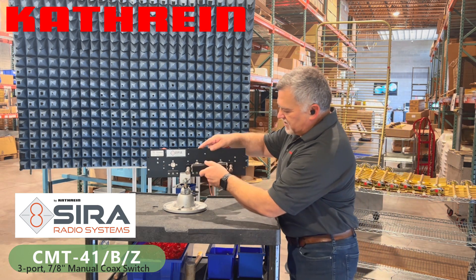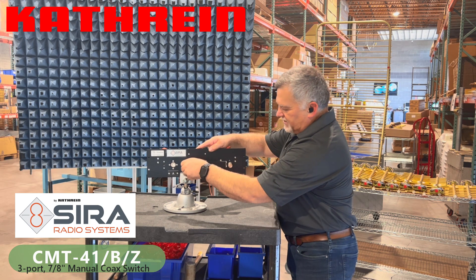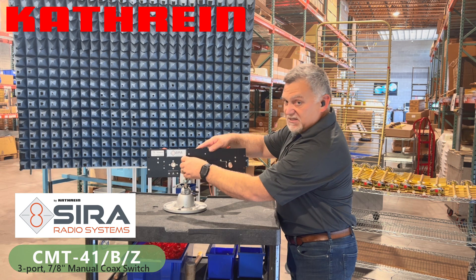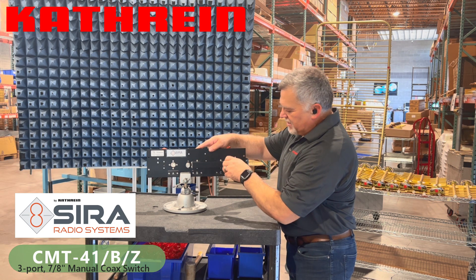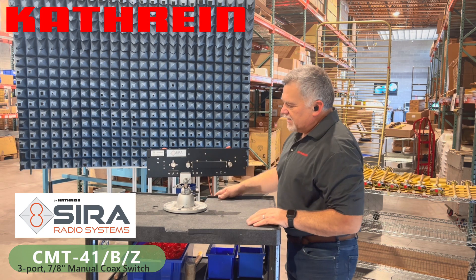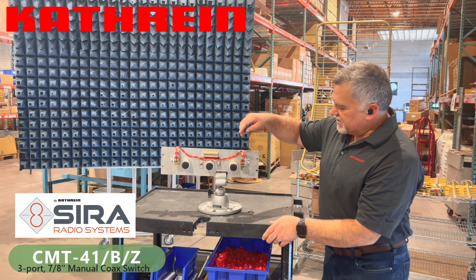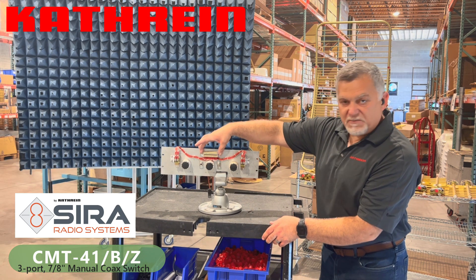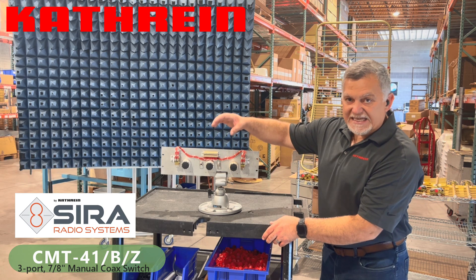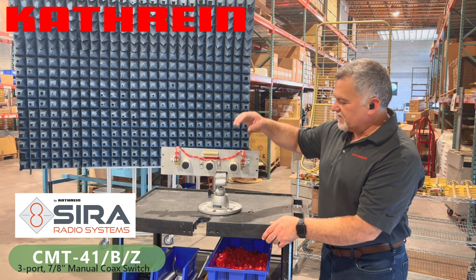He's going to move it over to his AUX antenna if need be, insert it, and lock the screws down. Now of course he should shut the transmitter down and then fire it back up once he makes the switch. But if he didn't, we've got you covered — this thing comes pre-configured for interlocks. We've got our interlock switches, everything nicely routed and tied together in a terminal block. We'll give you the pinout for the terminal block, making it as easy as possible to tie in your transmitter to these interlocks and give you that protection.